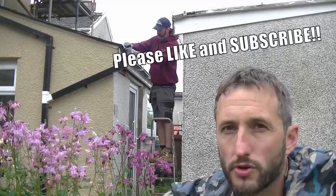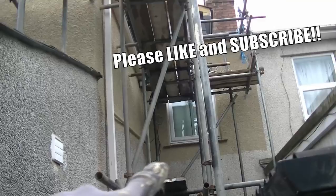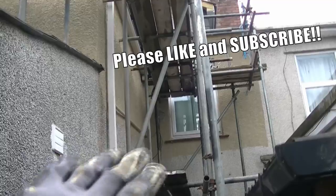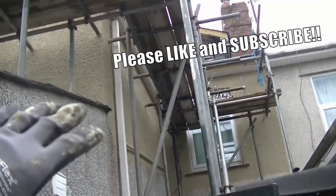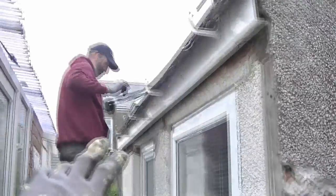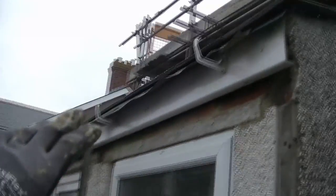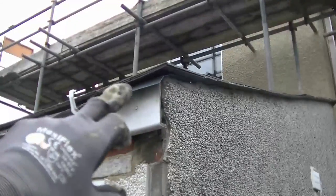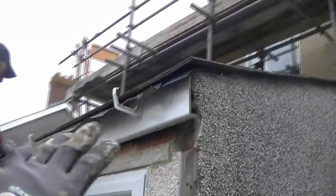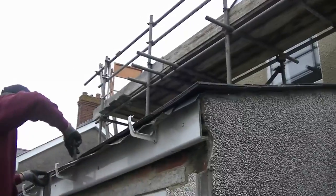I'll quickly go around the back and just show you something I did yesterday. Looking up here you can see where I've been doing the painting, I've got the paint halfway down the house there now, so I know I can work off that from a lower height scaffold if required. By doing that now it means we can start to put in some of the downpipes and get on with a few other things. You can see where we've done the soffit up there - we've got to do the fascia later. But for now across this back bit of the house, big house is just trimming a bit of felt down, because while we're here giving a bit of an overhaul, we thought we'd slip some felt support trays underneath there. This roof was actually done by a roofer a good few years back and they didn't bother using them then, so we're just going over and putting those in for belt and braces.